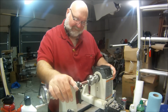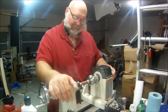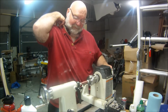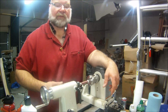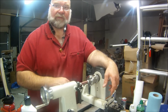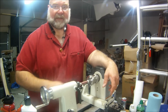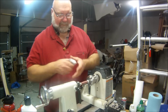You see a couple shiny spots that go along with the dark grain pattern. That's where the CA filled up some empty void grain. I did not use a sanding sealer on this pen. Some of my higher end open woods, if I do any burls, I will take Deft lacquer-based sanding sealer, thinned 3:1. And I will go over that 3 times with 10-15 minutes in between. That will give a nice base set. Something like Bloodwood, it's not bad to begin with.